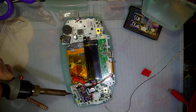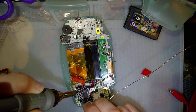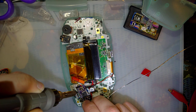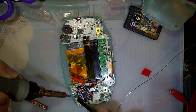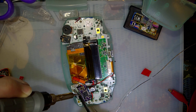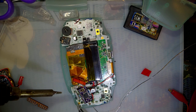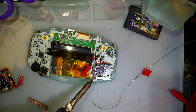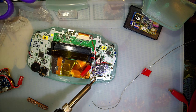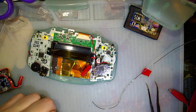one of these common pins on the back of the power switch. Any of the middle two pins. Does not matter which. On the plus side, instead of wiring this to the positive battery terminal, you should put that on this side of the fuse or on pin 2 of the power switch. Then your input will be fused there, or your battery board will be fused.